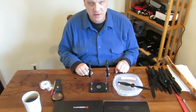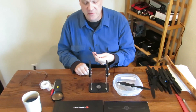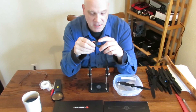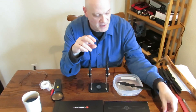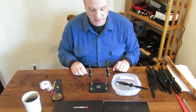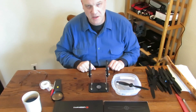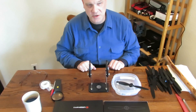Why do I balance my props? Probably because I'm paranoid. This is from an incident from about a month ago. With props spinning at the speed that they do, the centrifugal forces on the blade can result in a scenario where, if you have a small crack in the blade root, it can propagate and next thing you know, you've got a blade separation. I don't want to inflict my aircraft to that kind of damage. Out of balance props can also cause all kinds of camera issues — jello effect and numerous other things. A lot of people think you can calibrate the aircraft with accelerometer or compass calibrations, but if your propellers are not balanced, you're going to end up with issues and in some cases damage.